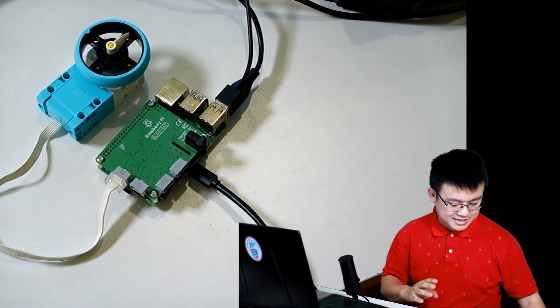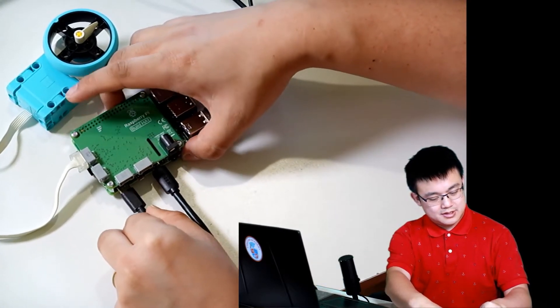Connect the power to USB-C. After connecting your Raspberry Pi to a monitor with the HDMI cable and turning it on, give it a few minutes to boot up and load the Raspberry Pi desktop. But if after a few minutes it's showing a black screen with no graphics and no blinking cursor, you'll need to follow the next steps. Take your micro SD card out and put it back into your computer.